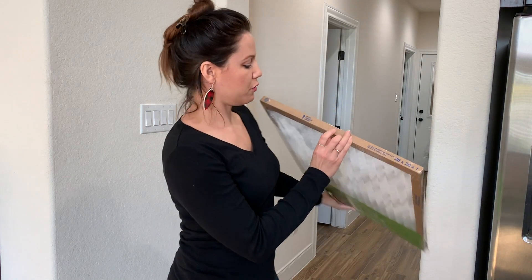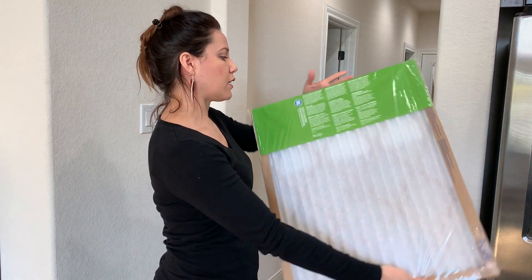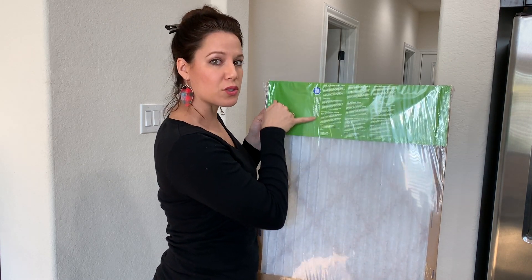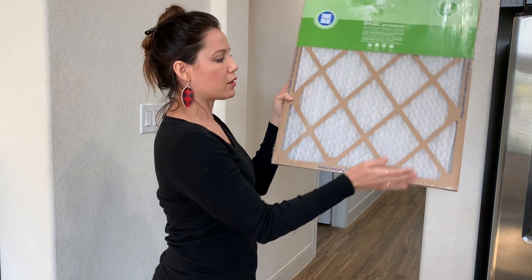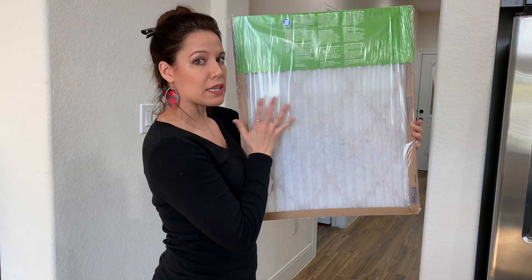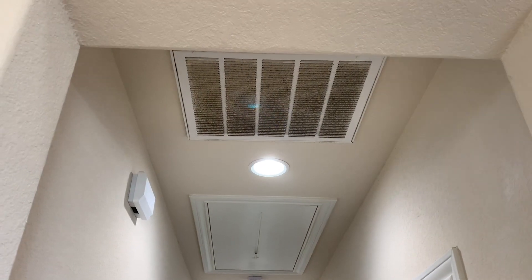This filter's FPR is five. One last thing before I open it — on the filter you'll see little arrows that say 'airflow.' This tells you how to place it into your air vent, and there are instructions on the back. The filter life and how to change it are also covered there. Notice the cardboard frame stays on — this side has a cardboard fence and this side is completely white, so it is particular in how you place it into the air vent.